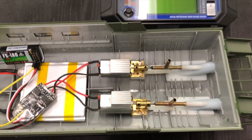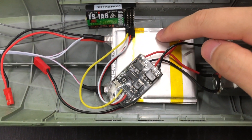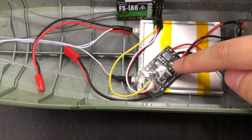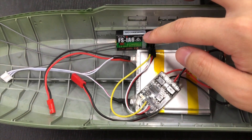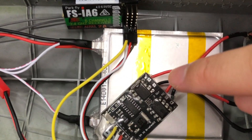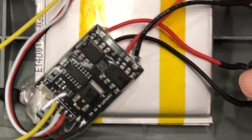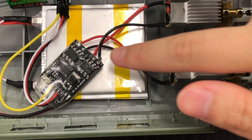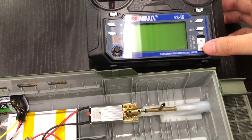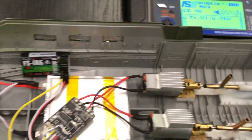Before the rehearsal, let me share the internal structure of my plan. Starting with the lithium-ion battery, which is our DIY approach battery, as the power supply. Then the ESC — the ESC signal wires will be connected with the receiver. You can see M1 and M2 are controlling the motors on the levers and thrusters respectively. Now we switch on the controller and check that my labels are in the right channel.